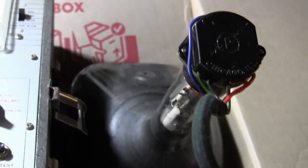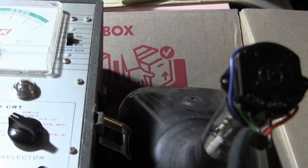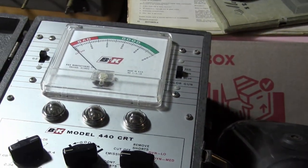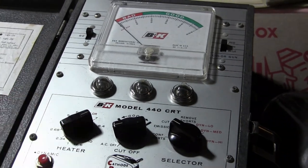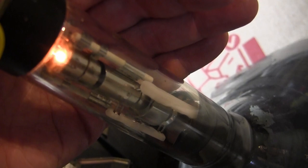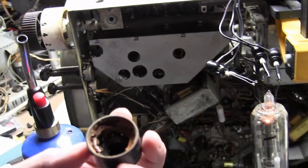If a broken wire can't be reattached, we might have an open cathode, which could potentially be re-welded - in fact I think I may have re-welded one in a CRT some years ago. This isn't just a matter of a worn-out CRT; even a worn-out CRT would give some blip when you check emissions, especially at elevated filament voltage - I'm at seven volts right now. There's no sign of blue glow; the filament looks fine.